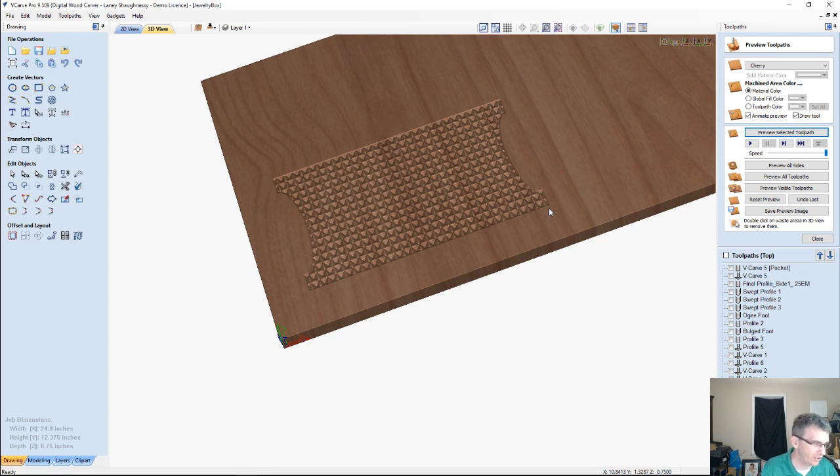So a table saw or chop saw might be a little hairy. But with a little miter box or a little pull saw, you can cut miters on there. Or you've got to make a jig to hold the parts so your hands are clear of the blades, and we can talk about that in the future. Hopefully this will give you something to work on, to get away from the signs. Let's make some boxes and some pretty things.